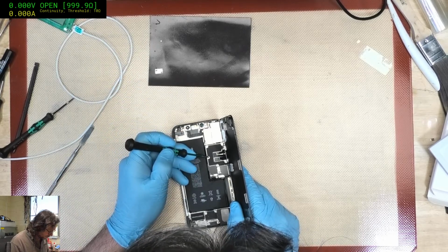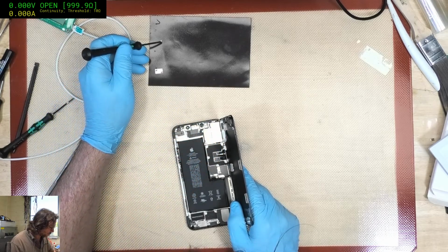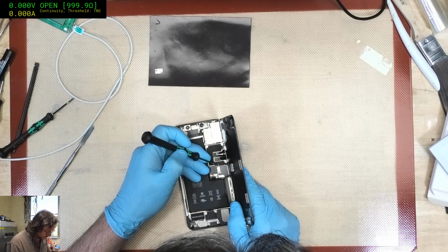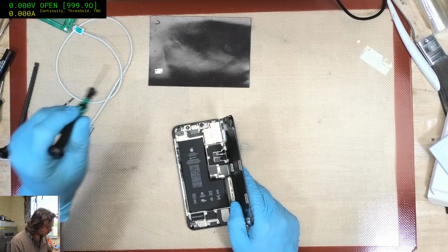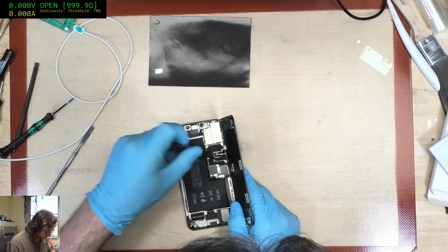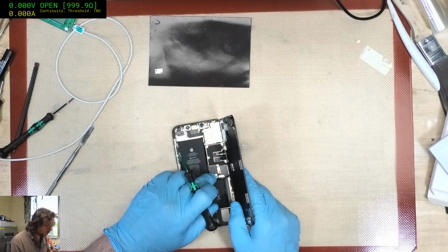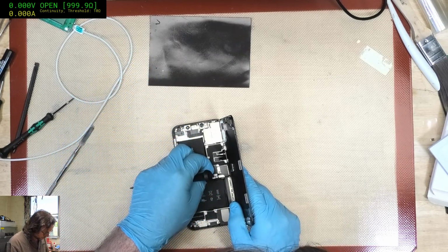They do have the same display, the primary display, the actual LCD portion, but they're all married with some sort of backlight, and I'm fairly sure that when they do that, the reflectivity of the original panel is slightly different, and so you don't quite get the dark contrast that you do. And of course, naturally, I haven't got any provision on those boards to drive a backlight. It would only just be a normal 200, 300 ohm resistor, things like that.